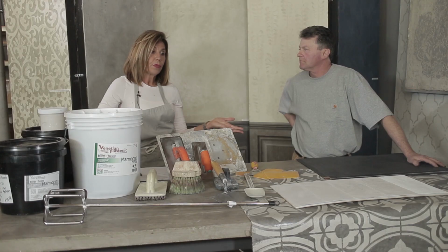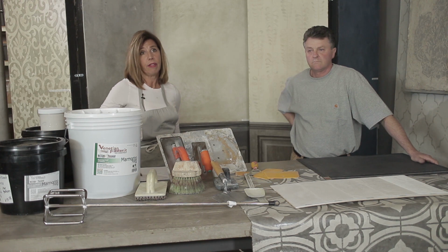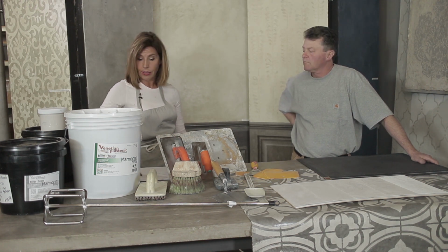One of the things about the plasters you're going to get asked when you want to get it applied is, are you going to use it on an interior or exterior? And that's going to determine a little bit of how we tint it for you. If we're going to do an interior, we're going to use some of the natural universal tints. And if we're going to do an exterior, we're going to use the natural pigments so that the UV rays don't break it down or make it lose its color. It will always patina and it will always fade a bit, but the natural pigments really hold their color for 20, 30 years, which is about the longevity of what you're looking for in a product on an exterior.